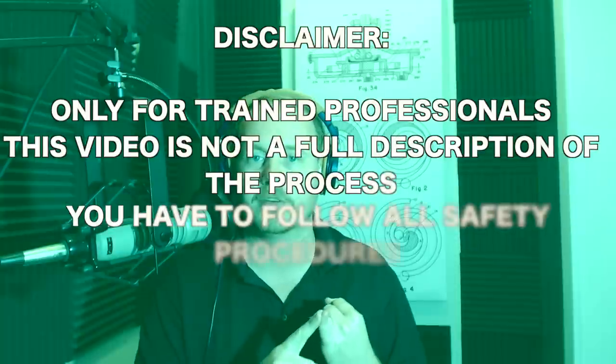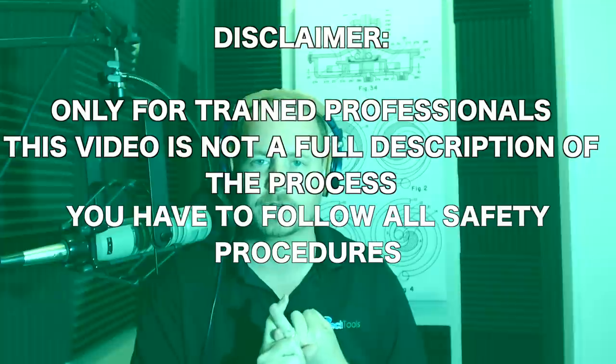Whenever we talk about gas, I have to be very clear, this is only for trained professionals. A video is not a full description of all of this, and you have to follow all best safety practices. One really important thing they showed is how critical it is to shut the gas off beforehand, shut it off afterwards, and make sure you get those plugs back in. It can create a very, very dangerous situation if you do not get those plugs back in and well sealed. And you should always use a combustible gas leak detector to check afterwards, as well as soap bubbles and good old common sense. So here we go.